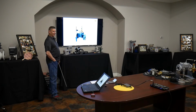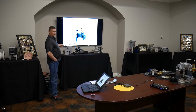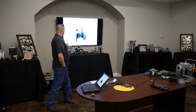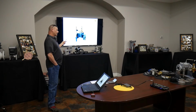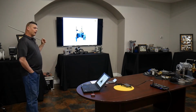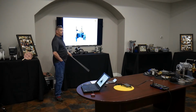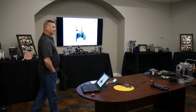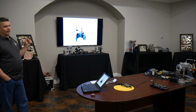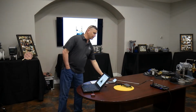It's got the wrong filter on it. Not stainless. It has an aluminum pilot filter with no drain. Okay, and it has a steel restrictor, not stainless. So from this, except for the fact that we can't tell without looking further what soft goods, what flexible element was put into the body, and what size throttle plate, which should be on a tag underneath one of these cap screws to tell us the capacity, we could completely configure that as far as the model. Well, that and the fact we don't know what the spring is in the pilot. We'd have to look at the spring sticker, but other than that.